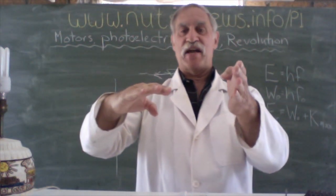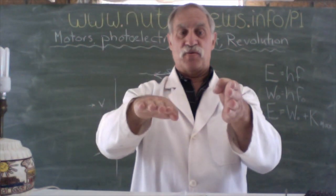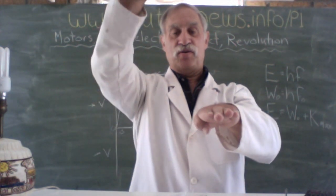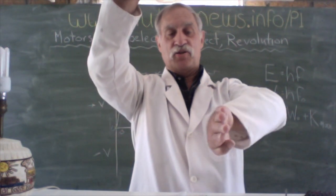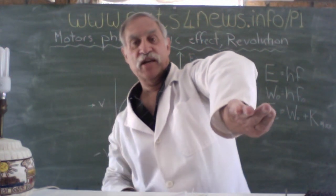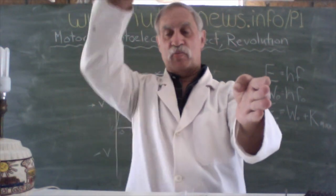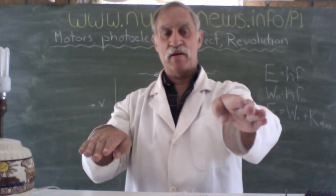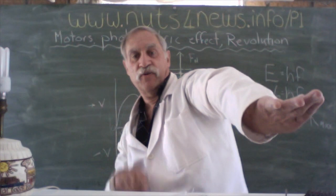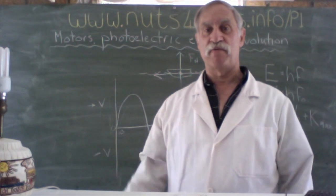And we could also get them to act it out. So there's the armature, right? Here's the field lines. What's the voltage? Naught. Now here it comes. Okay, so it rises to positive. Goes back to naught. Turns some more. Now in that position it goes negative voltage. Then it comes around again. And here it goes back to naught. Then positive voltage. Naught, negative voltage. And so by acting it out, the learners don't have to have a notebook full of stuff. They've got it up here.